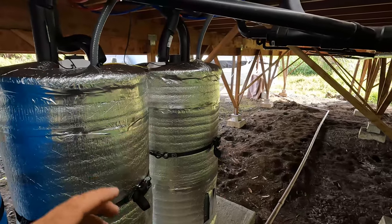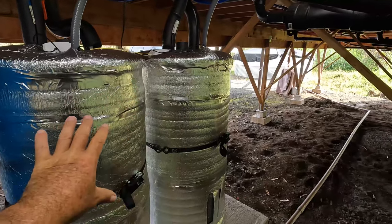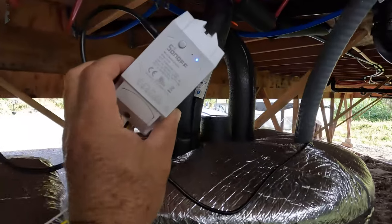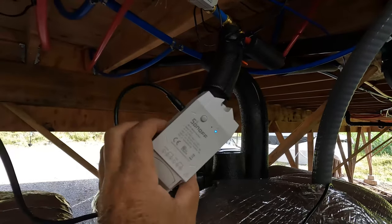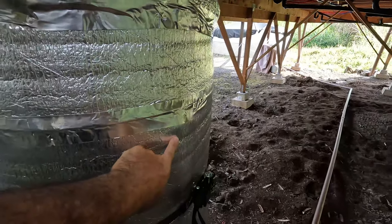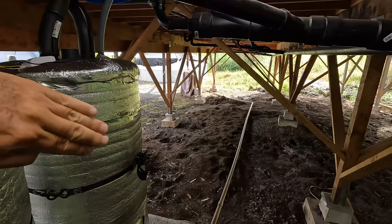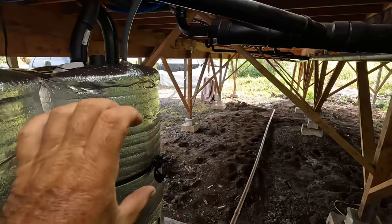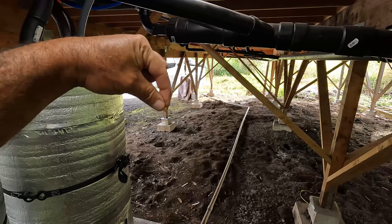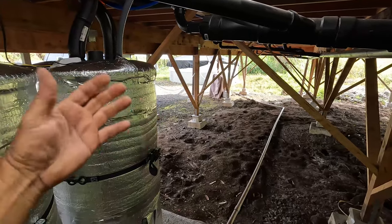The first of three components you'll need is the ability to read the actual temperature of the tanks. I have a Sonoff TH16 here — on the side is a plug that goes down to a wire sensor. It's plugged into the side of the tank, not inside the tank, but touching the tank. At the service panel, where you remove the insulation, I fished the sensor in so it's actually touching the tank itself — not any connectors, just the tank.